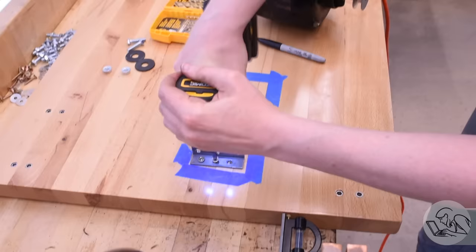Now it's time for some very embarrassing woodworking — you are not going to enjoy this if you are a woodworker, because I do not know what I'm doing. I've put some blue tape on there and clamped a backing board on the far side to hopefully minimize tear out. In hindsight, what I maybe should have done was drill the series of pilot holes from this side and then used those pilot holes to do the paddle bit drilling from the other side, which would have eliminated tear out on the side I care about. Also, a Forstner bit would probably be a better choice, but I didn't have one in the right size. After chain drilling out the slot, I got out the one and only chisel that I own — it is a good one and very sharp — and was able to clean up the slot and square up the sides to make it presentable. I left the ends round because I thought that looked nice.